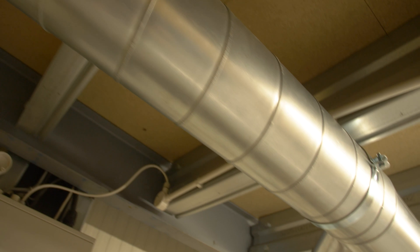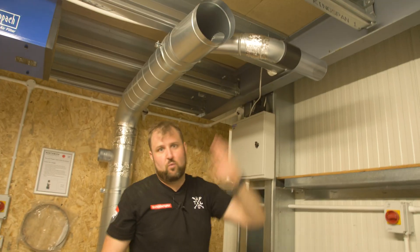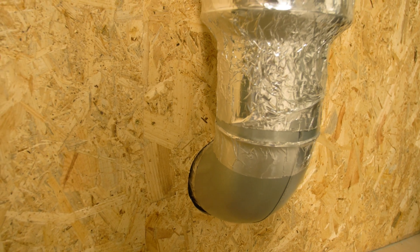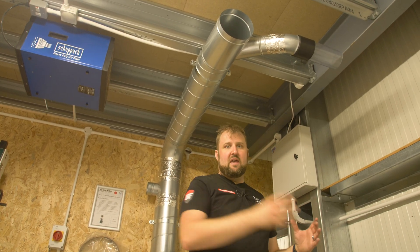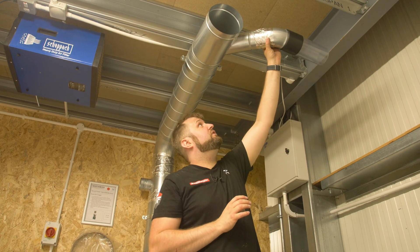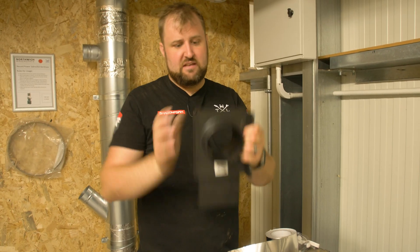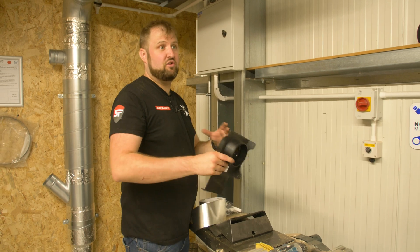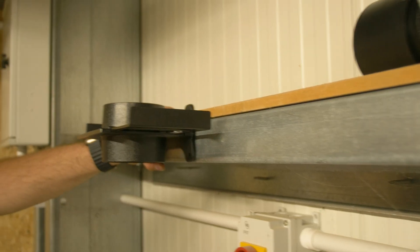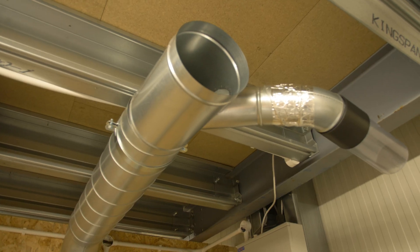Across the top we're going to be using a Y — not a T — so the takeoff runs in line with the airflow and we're not using any sharp elbows. We've had to use elbows here at the bottom just for space reasons, but across the ceiling we're only using 45s to make sure the dust and air doesn't go round a sharp corner. We'll have a 45 and then another 45 bringing it down to a blast gate. This is a 100mm blast gate — it cuts off the airflow to each machine so we're not losing volume with an open leg doing nothing. Each machine has got its own individual takeoff you can open and close. So I've got to finish this 200mm leg, do some of the takeoffs, and I'll give you another update when I'm further into the project.